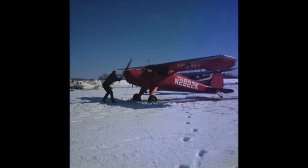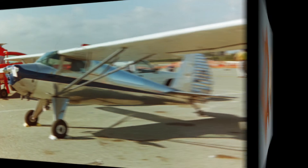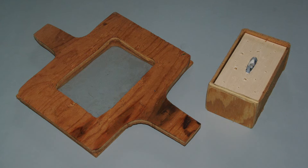Let's make it clear right now that I am not an expert at this — this is just how I managed to blunder into it. There are also other materials I am sure. This method would not be very good for a serious production run as the molds would be too fragile. Briefly, vacuforming is a method of molding plastic where a sheet of plastic is heated so that it is pliable and placed over a mold connected to a vacuum source. When the vacuum is applied, atmospheric pressure pushes the heated plastic into the mold. There are two types of vacuforming.